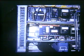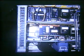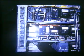AC fuse protection is provided for individual items of radio equipment that require AC power. The fuses for these items are located on a panel of fuse holders on the lower left side post of the radio rack. Directly above this panel is a row of circuit breakers for the DC power required for certain individual items of radio equipment.